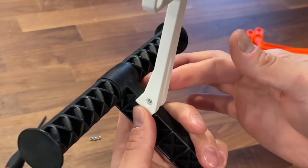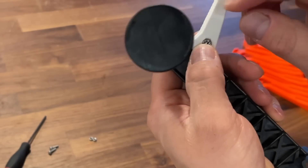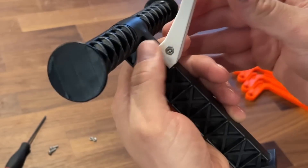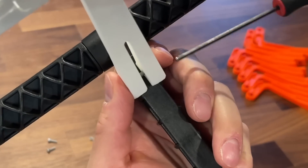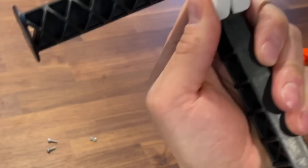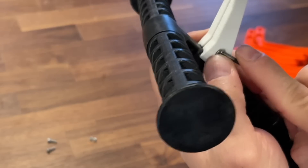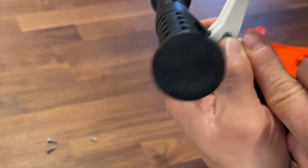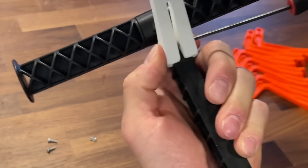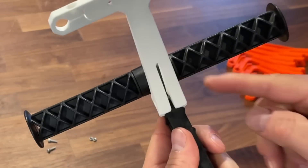Kind of clip it right on there, and then you're going to want to hold that screw in place and push this nut in. You could also do it the other way, where you put the nut in first and then put the screw in, just like that. Then you take your Allen wrench and screw it in there. What that's going to do is tighten it and hold it on to the spool holder. Sometimes I like to use my Allen wrench to push the nut in there. Now it's gripping — just do it so that it's tight enough that it's not going to come off. That is the mechanism to hold it to your spool holder.